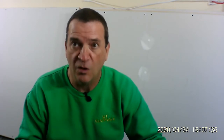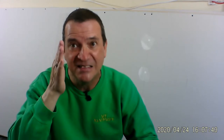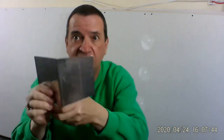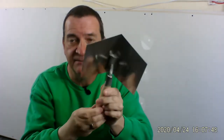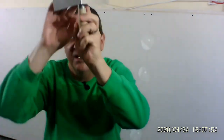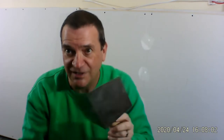The next knife is kind of unusual looking, but I use this quite a bit when I'm drywalling insides of rooms and getting into an inside corner where your pieces go together. I'll put the drywall mud on both sides of the walls and take this all the way to the top, stringing it all the way down, and it gives me a very nice line. This takes a little bit of practice, but it's really nice to have.